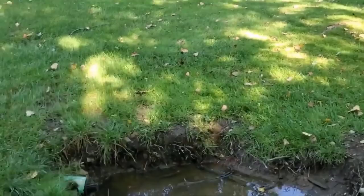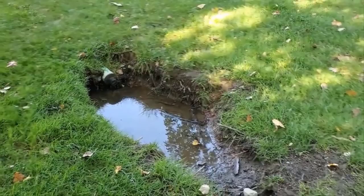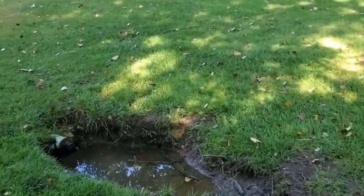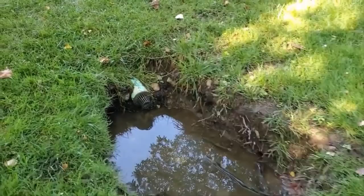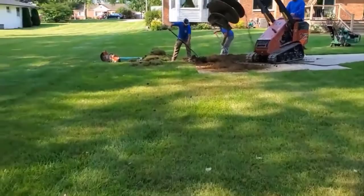When you try to discharge your sump pump line and you're asking the water to be absorbed by the subsoil in a high concentration, it's just not going to happen. It has to be dispersed over a very, very long area, and you really do need to engineer some sort of leach field that has a reservoir large enough to hold bulk water and let it leach over time. Obviously, we have some good soil here at the surface, but we get in the clay after that 16 inches.